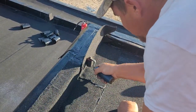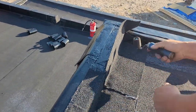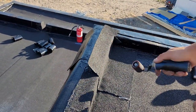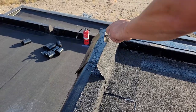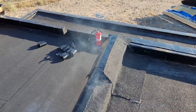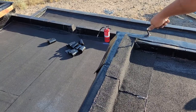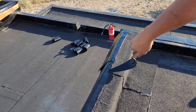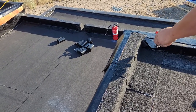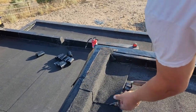Use the roller, get that all sealed and push out some bleed out — beautiful. Double seal: whenever you're sealing with the trowel or anything, you should always seal and then push. The first swipe with your trowel is to seal; the second one is to push out the bleed out, which again you want an eighth to a quarter inch everywhere if possible. Okay, bottom lap here.